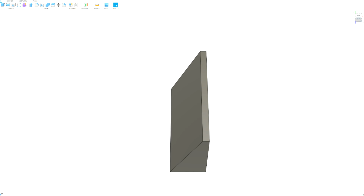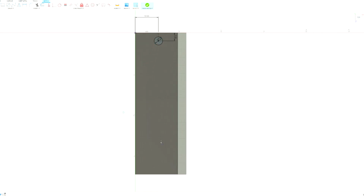Now I'm going to add in some pegs, because on the bottom of the controller there are these little holes that are meant for the screws to hold the controller together, but I'm going to use them as mounting locations. So I have to measure that back, and it's about 13.5mm or so. Then I'm going to put in a circle that is about the same size, but since it's diagonal it's a little hard, so I'm going to undersize the hole a little bit. The print's going to be a little larger anyways, because the plastic expands, so we can shave it down if it needs to, or glue it in if it's a little too loose, but I think it'll be fine.